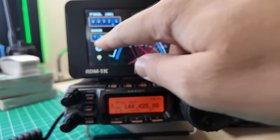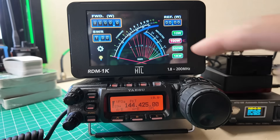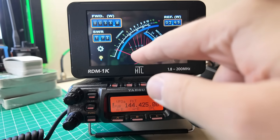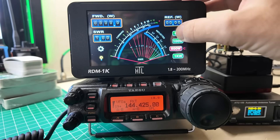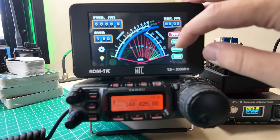Pretty high reflected power, 1.8 SWR, and that's on the 100 watt scale. On the 500 watt scale the numbers don't change but the needles are a little bit lower because the power is lower — and this should be off the scale. That's a pretty quick reaction time. Obviously my 2-meter antenna is pretty lousy but the meter is pretty good.